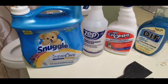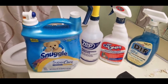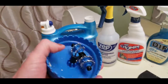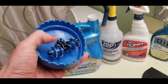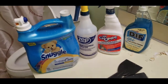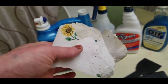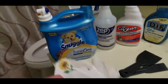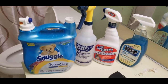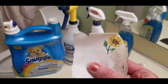The first thing I did was use just water and fabric softener — recommended from a YouTube video I watched. It did work, but it wasn't getting underneath the wallpaper well. So I got this tool called the Roman — you roll it on the wall and it makes perforations in the wallpaper. You don't want to press too hard because it will ruin your walls, but it's enough to get perforations in so that when you spray, the water gets underneath. That did help loosen things up. Even with that, you have to be so patient — you have to let it sit and soak before you start removing it.